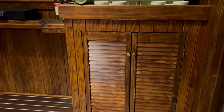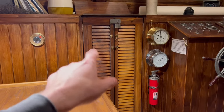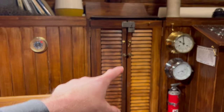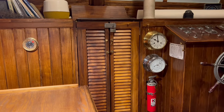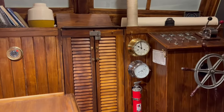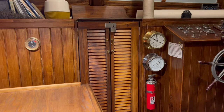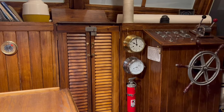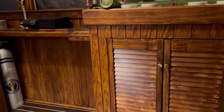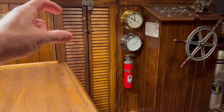I went with 12 inches — good enough, since you never really see this in the movie. The doors up here needed to be 10 inches wide and quite different, with thin frames on the insides and thick frames on the top and outsides, as shown in the movie. I took apart the top half, cut all the louvers down, put them back together, and changed the frames to make them thicker. The knobs and latches are as close as I could replicate. The louvers are a little tighter than on the actual Orca, which had a slightly bigger gap.